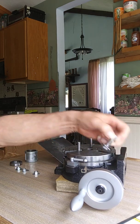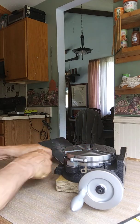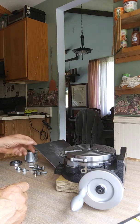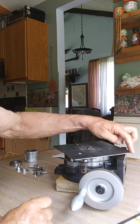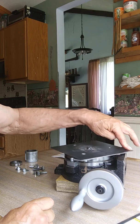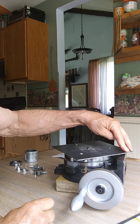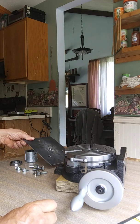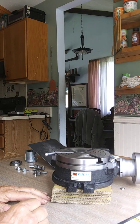So the table does not come with T-nuts — make your own T-bolts, make your own flange, and you're ready to go. Because I made my flange kind of large, I would have a problem using the table vertically since it would come in contact with the milling machine table, but you just cross those bridges when you come to them.